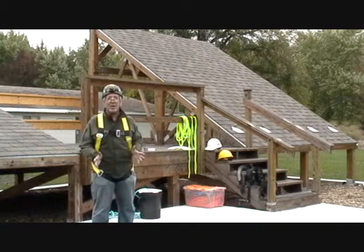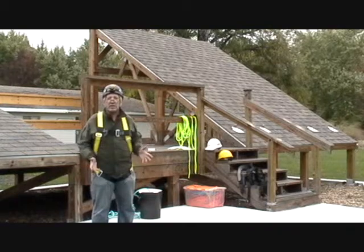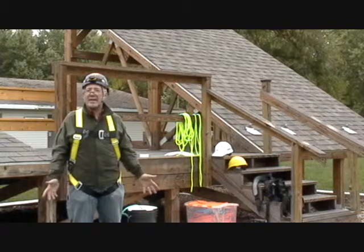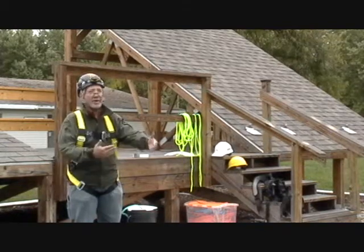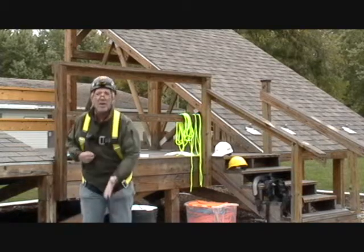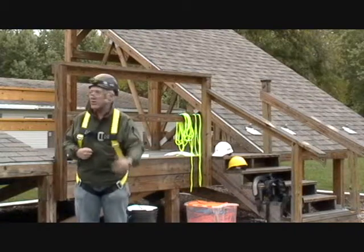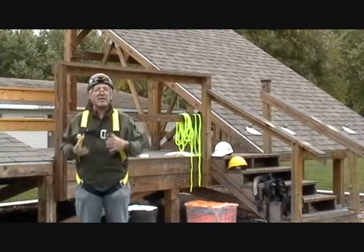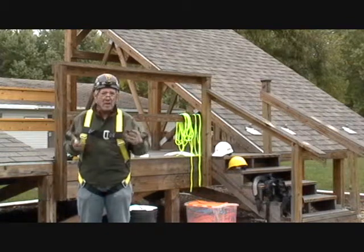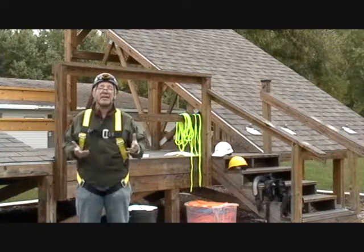Here, though, is why most photovoltaic arrays go on the roof. That's the only place in a relatively small residential yard where someone might not have a shading issue. The only way to get rid of a shadow from a tree is either you have to proceed to the north or you have to go up. Typically, the only place in a yard that you're going to be able to go up and do that is on the roof. And because so many PV arrays are roof mounted, most customers who are not well informed assume that's the only place it can go.